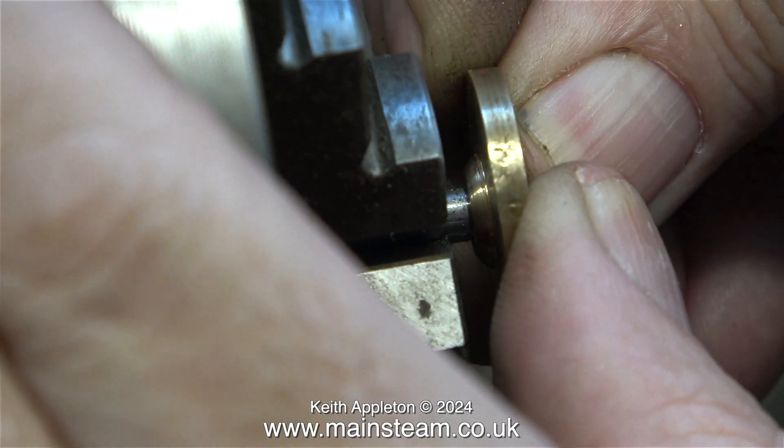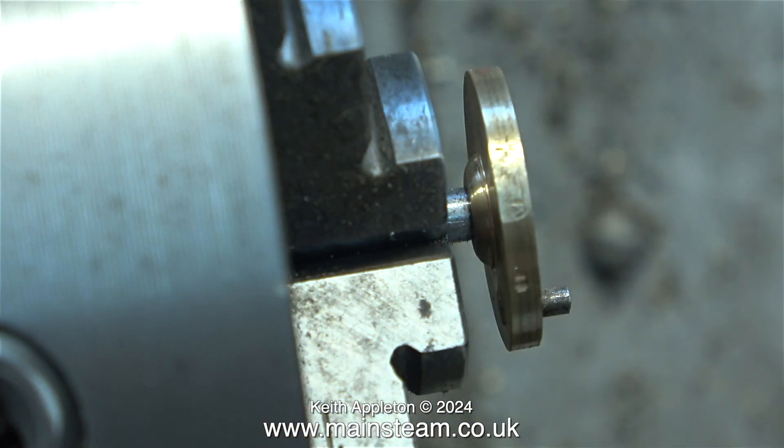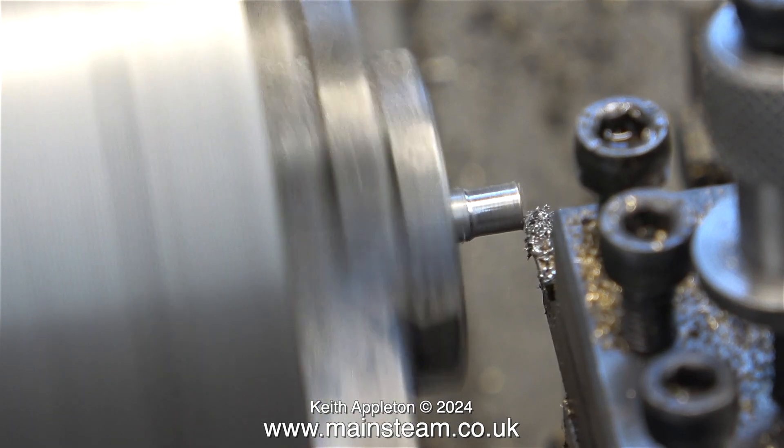The very last part of the turned crankshaft is an interference fit, so the crank web will locate accurately on the crankshaft, but there's enough room in the rest of it for the Loctite 603.